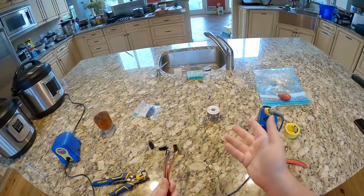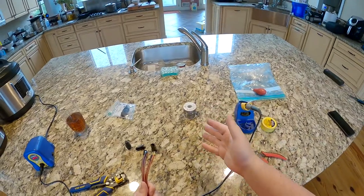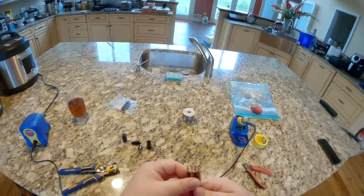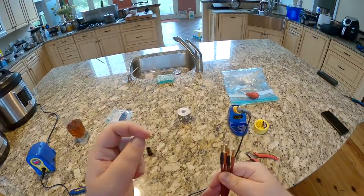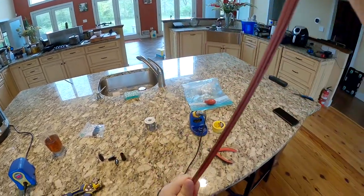In most speaker amps the ground terminals — the negative terminals — are all shorted together; they're just one ground bus. So you can legitimately hook up a grounded headphone to it. But for some reason most places that put a headphone jack on an amp don't do that — they always put single-ended. And I'm like, you can put balanced — well, it won't technically be balanced, but all speaker amps are essentially balanced internally regardless.